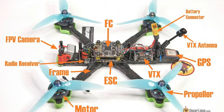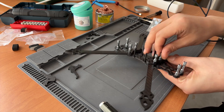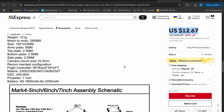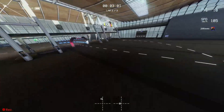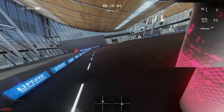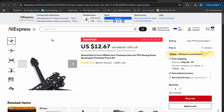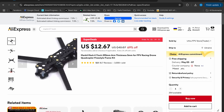Let's start from drone anatomy. First, we need a frame to hold all electronics. Most frames are made of carbon — they are light, reliable, and actually not so expensive. You have two options: buy a good brand frame or a cheap copy. In my opinion, you need an original frame only if you are racing or doing freestyle professionally, since a high-quality frame gives you more control due to lower vibrations. But for practice or hobby flying, you can screw motors to a piece of wood and it would be enough. I'm going to use a cheap copy of the Geprc Mark IV, which I found has a good balance between price and quality.